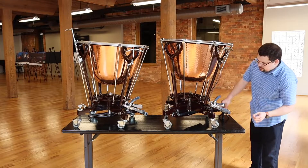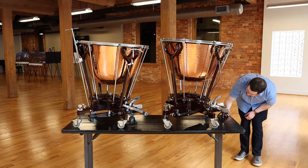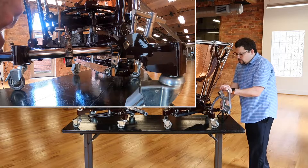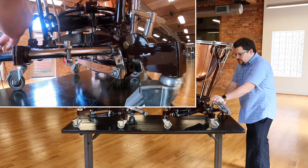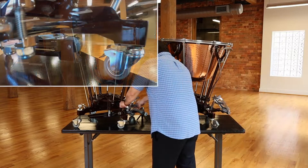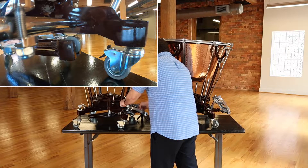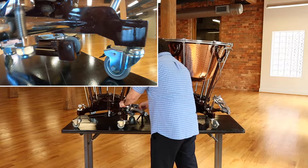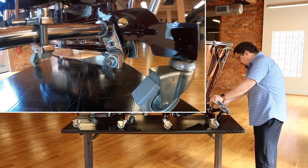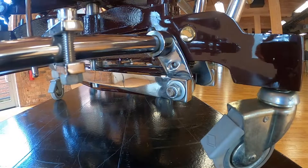The pedal shaft, which is exactly the same as the one on the Mark 11, is connected to what's called a transfer bar, which is this silver part right here. On this Mark 14, there are two transfer bars on either side of the pedal shaft. When the clutch is released, it moves the transfer bar, rather than the bell crank or the cam, which on the Mark 11 is located right down here on the inside. On the Mark 11, when the pedal is operated, there's a cam at the end of the pedal shaft that makes rotational force become vertical force on the piston and the spider. On the Mark 14, when the pedal is used, instead of a cam, the lever system that attaches to the transfer bar sends that same motion across the drum.